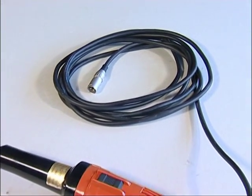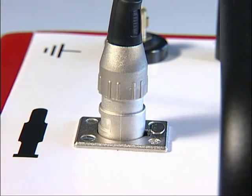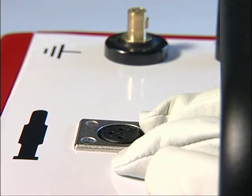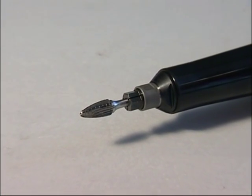The 42-volt grinding machine has a substantial cable and an XLR bayonet-type connector which, when plugged into the battery unit, will lock into place. This is released by the small button mounted on the socket. The grinder has a collet attachment designed for use with burrs and other surface preparation products with a 6mm diameter shank.